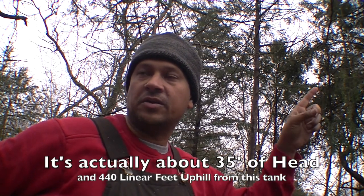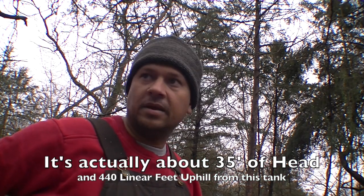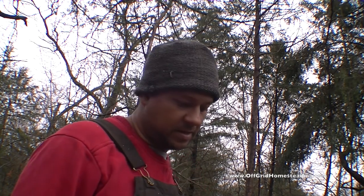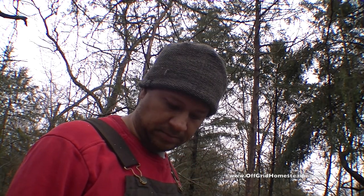With this new submersible pump we're not going to have any issues with priming anymore. After all the iterations of pumps I've used, this little orange one works like a solar well pump — because we're not pressurizing a tank up top. It just drops into the tank from the PEX right into the inlet hole on the side of the tank. That's why you can actually pump that far: it says it'll pump 100 feet of head, and we're only going 50 feet. I had the other pump running at the pond and it pumped from the pond all the way to the top of the hill. I know it works. I'm just glad this is done.